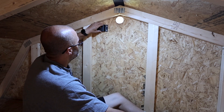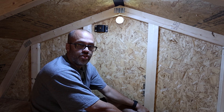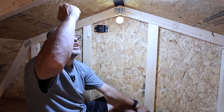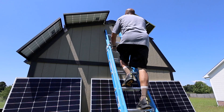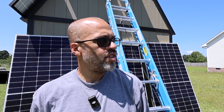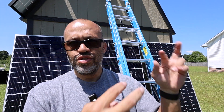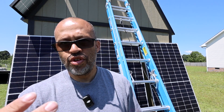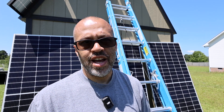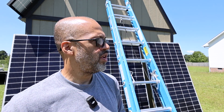The level is going to matter on the outside since the bracket has some play and movement. Going outside where it's probably cooler — it's 60-something degrees down there but warm up here without insulation. Got two of the nuts on outside just to hold it together, pushed the other two bolts back through and connected the nuts. If you have two people you can do it easier — one person holding the bolt while the other tightens — but I was making it as easy as possible on myself.